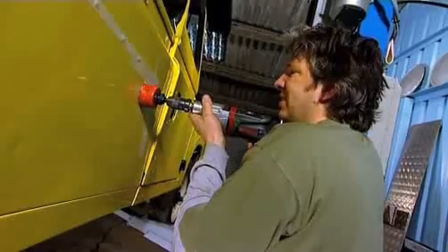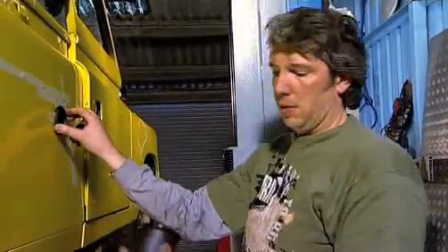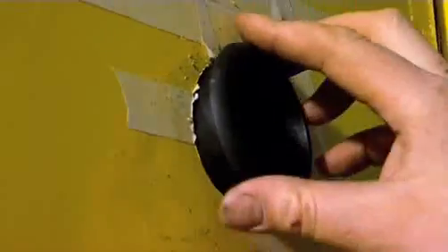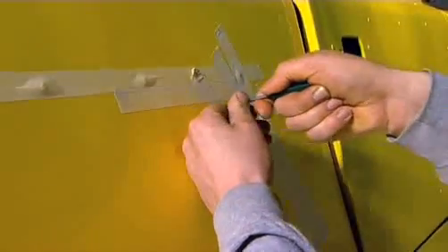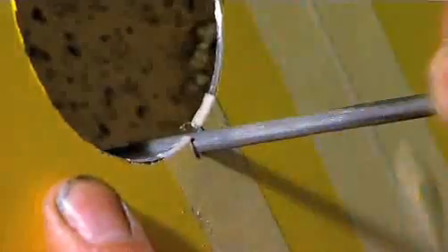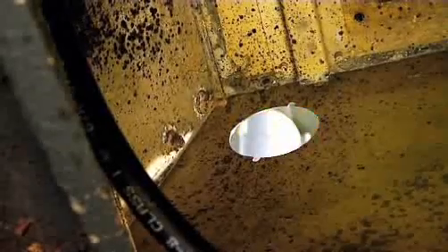Don't want to go too fast with this. So what's going to happen is that's going to pop into there, and this is going to go on the other side, and it's all going to bolt together. But there are little lugs on the top or bottom, so I have to get a file and just file that — that stops it all rotating. I'm using a round needle file because it gives me real accuracy, and the part fits like a glove.